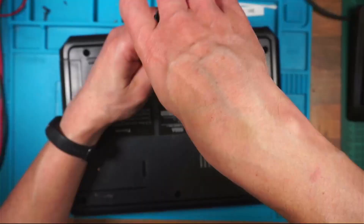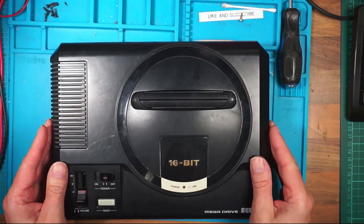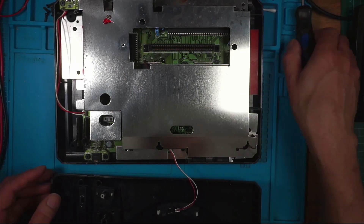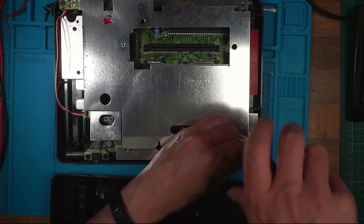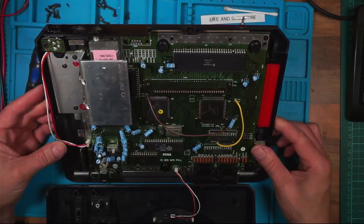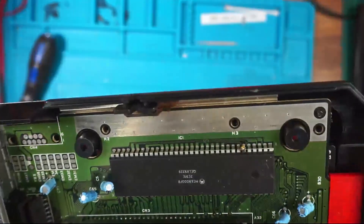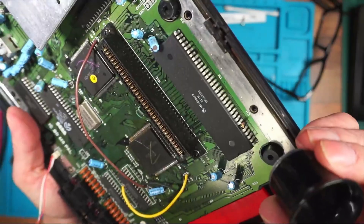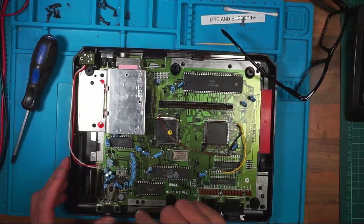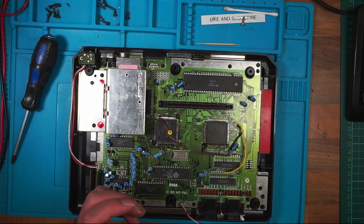It's a bit grimy, so if it's just a faulty reset switch it's going to be a short video. I don't remember seeing all these wires before — been a while since I've had some kind of mod. Someone's pulled a pin up — it's a little tiny resistor. That's strange, I've never seen that before. So with this out I'm going to try and plug it in now, and if it works it's just a dirty switch. It's really gritty.